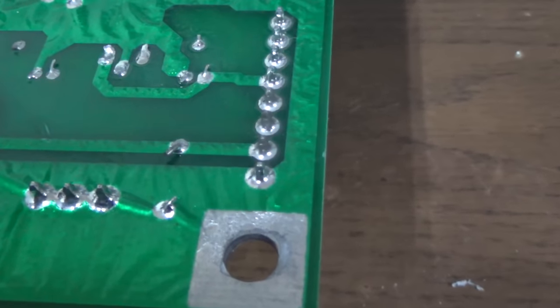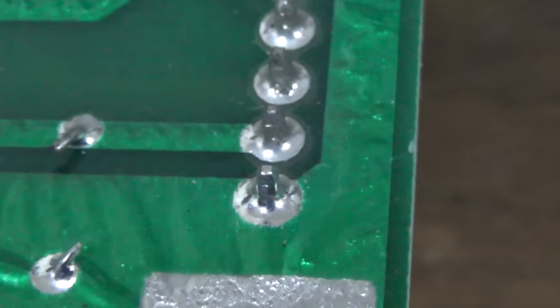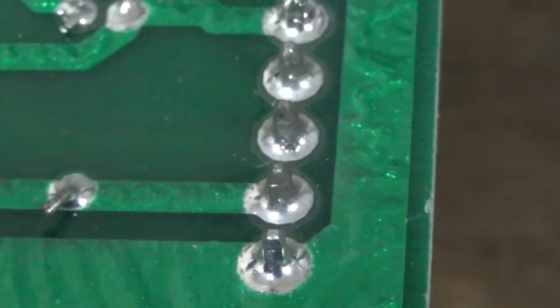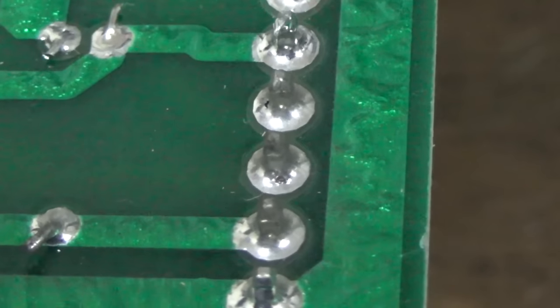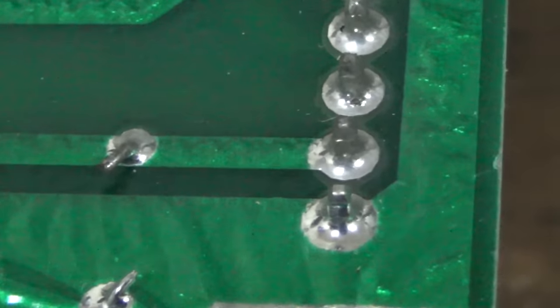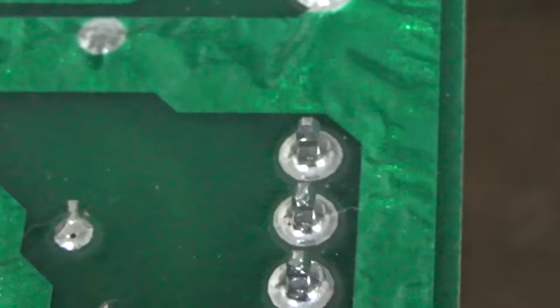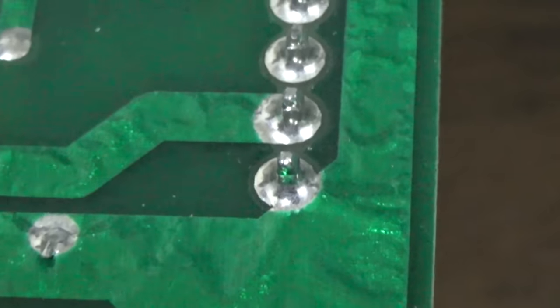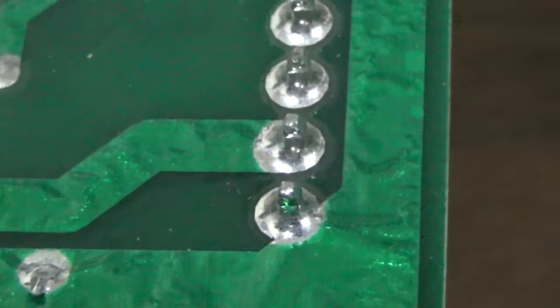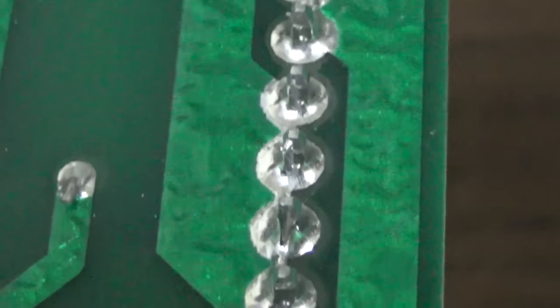We're looking for a cold solder joint that might explain half the voltage being gone. You know, when I think half the voltage is gone, though, boy, that sure screams bridge rectifier to me. But was it half? I think it was like 1.6 or something, wasn't it? So that's not really half. Sometimes if it's exactly half, it's because there's a bridge rectifier somewhere screwed up and only one leg of the AC voltage is getting through, and so it comes out as half.